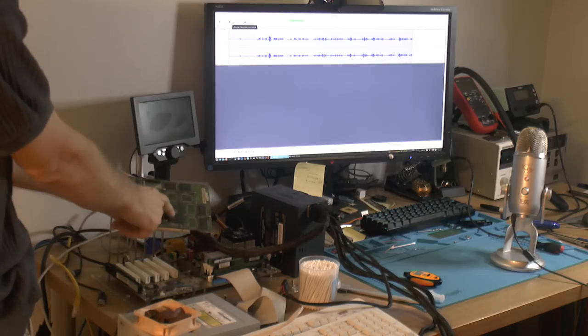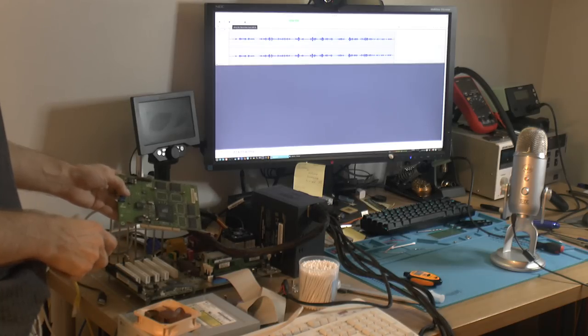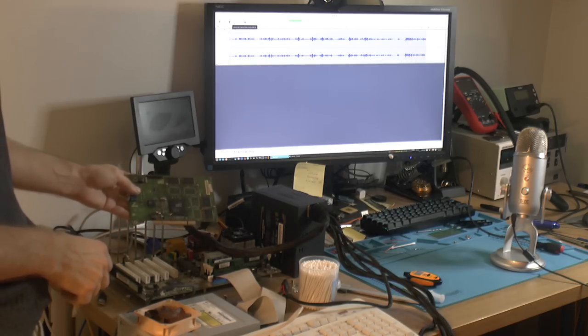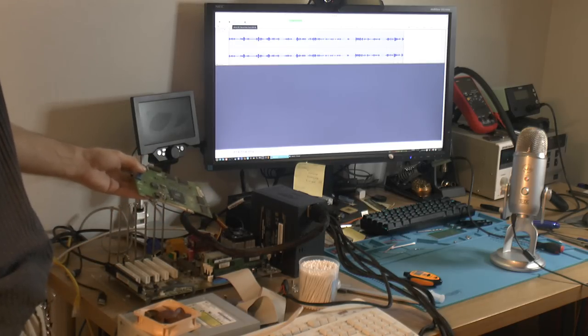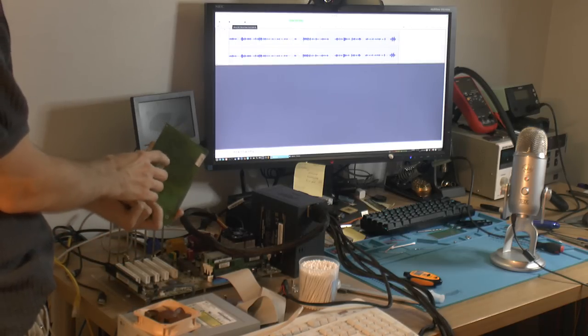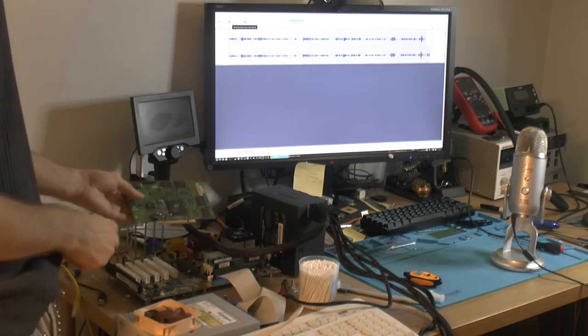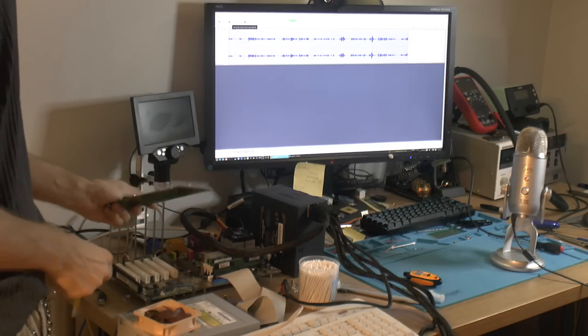That's actually how most old GPUs were cooled up to the GeForce era, at least, I think. Because everything basically up to GeForce 4 is essentially the same. With the FX cards, and probably the 8500, don't know exactly, like the 9000 series, and before then, everything was mostly cooled by the PCB actually. So that's why you get diminishing returns trying to put a big heatsink on the front. So you can actually cool the back a bit still.